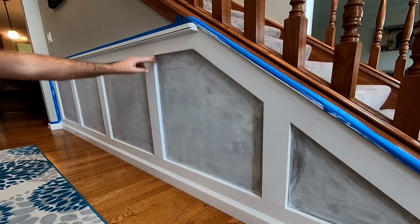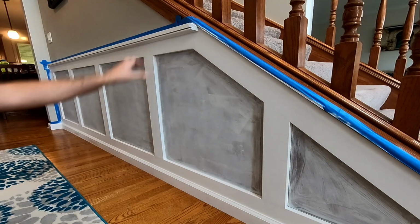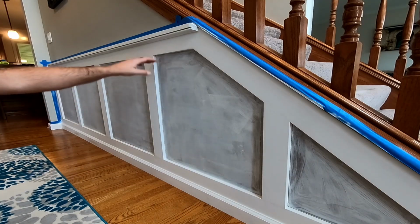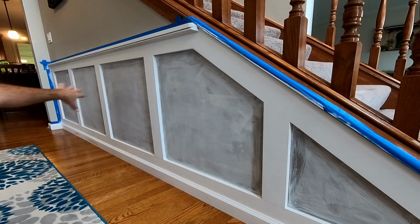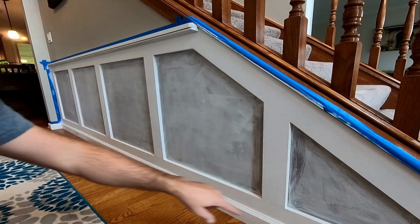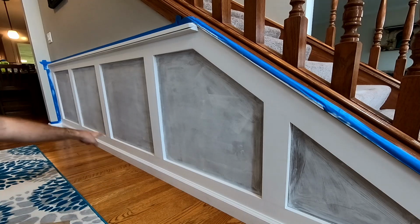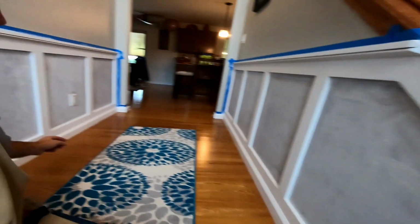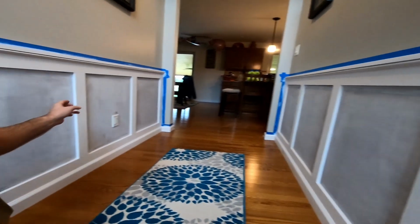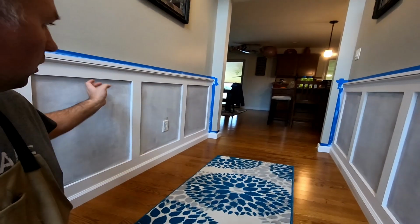What you have to do is, this is all the same height in here, all of these squares, because that's the way it goes when this is all level. So I built this so it's all even. So I have to cut 13 pieces up just shy of 26 1/4. Then I'll have this piece and this piece, so I have to cut those 2. And then these angles I'll have to cut. But these 3 will be the same size lengthwise, so 6 pieces there. And then same over here. These are the same as these ones, but these will be a different length because these 2 squares are a little bit different on each side. So I got to cut all these trim pieces.